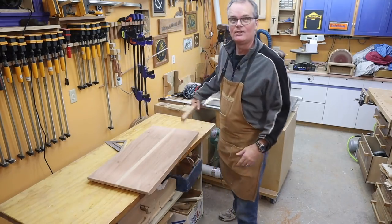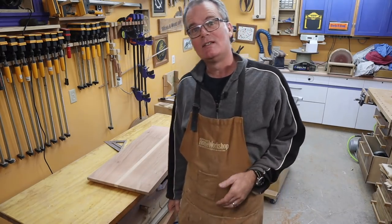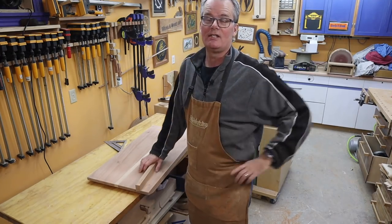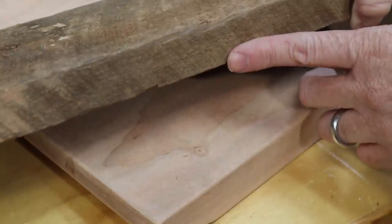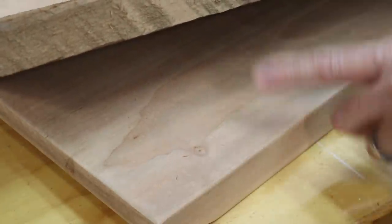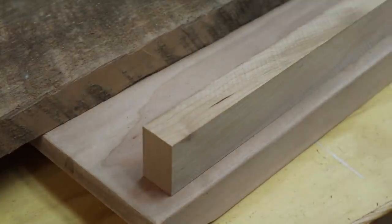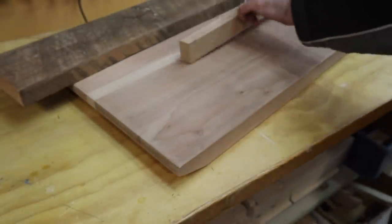And really, I have a table saw and I have tools. Cutting a thing in half is something I've done before and it's something I can do again. Just earlier, off-screen, I went looking through my cherry stash, and this time I grabbed the darkest one I could. Now there's a lot of grime and dust on here, but I grabbed the darkest board I had, took the block plane and took a few swipes — and I'm getting the color that I want now. So I cut a chunk of that and I've got it to the proper height and the proper thickness.